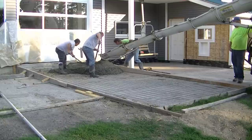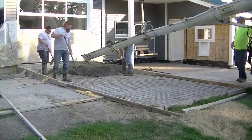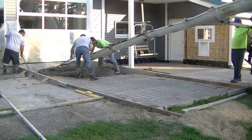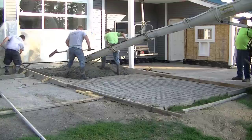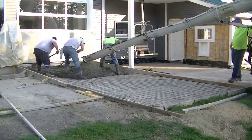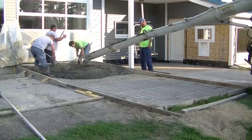When we're pouring concrete this thick over existing concrete, there's not a heck of a lot of prep that we need to do. We just clean it, and if there's some major cracks or anything like that we'll repair those. But on this particular job, the old concrete patios underneath were in pretty good shape — they were just really old, and the tops were really scaled, peeling and popping. They just didn't look good and weren't worth resurfacing in our opinion. Plus he had room to bring the grade up a little bit anyway, so we just decided to pour new concrete over the existing rather than try to resurface what was there.